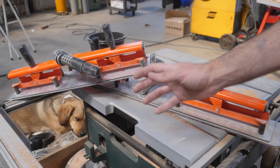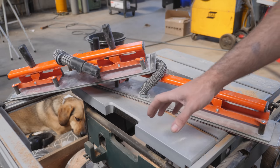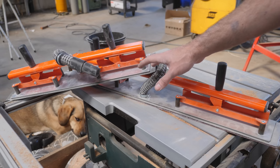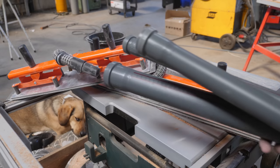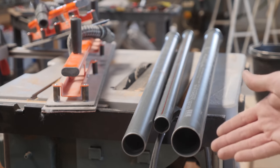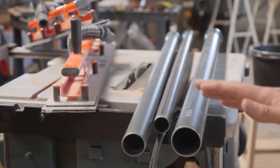The first couple of steps, drawing the lines and removing that first initial chunk of material, is going to be the same for both strategies, but after that I can either use my boards from Flexi Sander here to round over those two corners, or I can go with something like these pipes here. The idea being to cut a chunk out of one of these that matches the radius I want, line that with sandpaper, and then use that to form the radius.